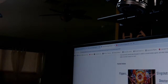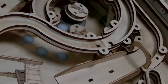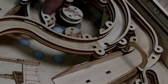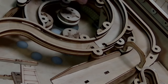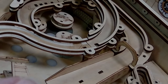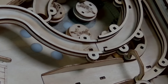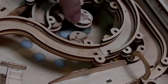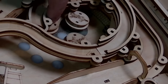Now let's talk about those pop bumpers. Here are the three pop bumpers — be careful with the X-wing nearby, you can easily break it. There's one here, one here, and one here. This bottom one was the only one that would work; these two I could not get to work at all. The way these work: there's a little metal piece you can see underneath them, stuck to the board, and in the back there's a bolt that goes through to connect it to the other side. When the ball rolls on the metal mesh and contacts the metal underneath the pop bumper, it completes the circuit making it fire — but for some reason only one would work.